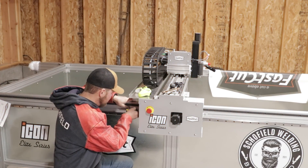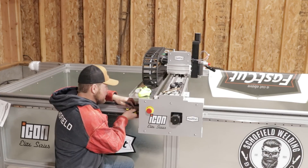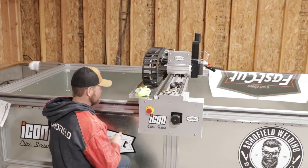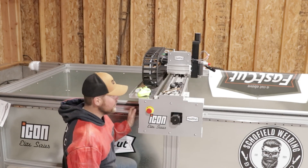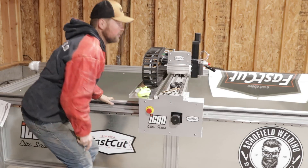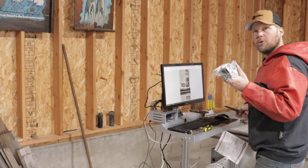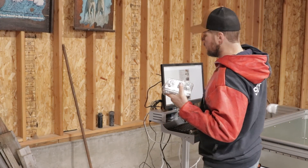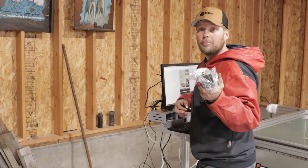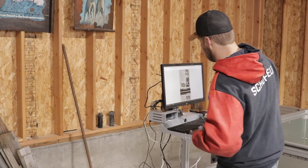One of the things it says on your packing slip when you get this — it says it right on top of the gantry: 'Do not operate until you have read the manual.' The manual talks about these little L brackets that are actually holding the gantry in place for shipping. If you run this and don't remove these, you will destroy your table — thousands of dollars. So you've got to make sure you remove all of them and read all your instructions. These are the brackets to mount the table that the plate's going to sit on to the table that the gantry's going to sit on, so we've got to actually build that, which is coming up in another video.